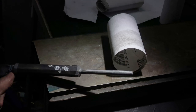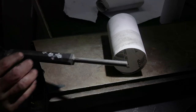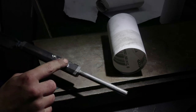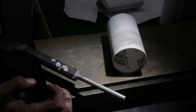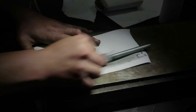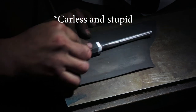Now, the dust that comes off the mother of pearl is carcinogenic or toxic. I did a little test piece without a mask, obviously not knowing how bad it is, but once I looked up the tutorial, I became aware of the health effects. Now, obviously, I've got a mask on and I'm cautious. So my goal is to make you guys aware, if not already, and if you are going to do this in the future, just keep that in mind and take care of yourselves. Because I was just careless.